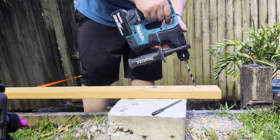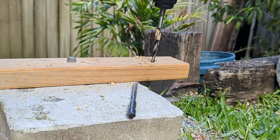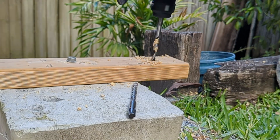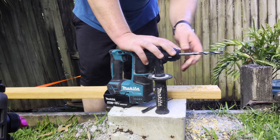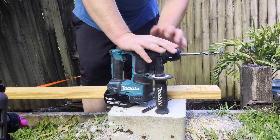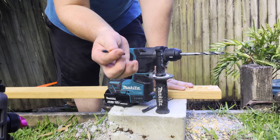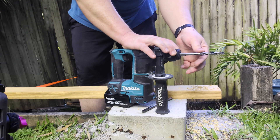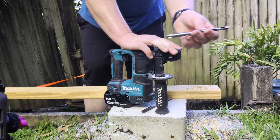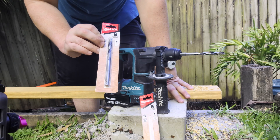So anyway, let's see how that goes — that's eight millimeters. Yeah, really nice. So this kind of drill bit, that is pretty specialised — very esoteric. But it is going to be a really nice, reliable way if you're working at heights or confined spaces and you don't want to carry too much stuff. A lot less bulk, and much more reliable and less annoying than having the little bits falling out of those adapters all the time. I've only seen these made by Makita — pretty hard to get. My supplier here only has a couple of sizes, but I think I saw some on Amazon too. There's the 10 mil one.